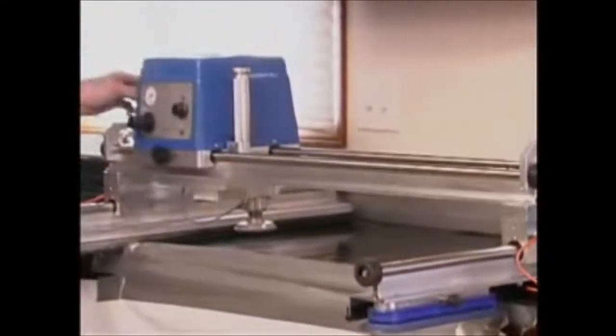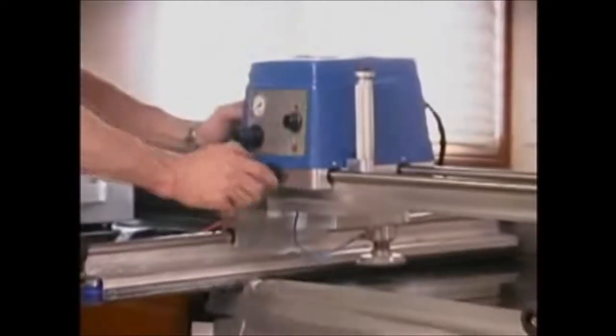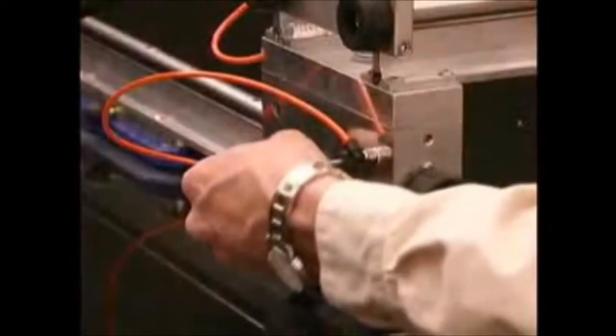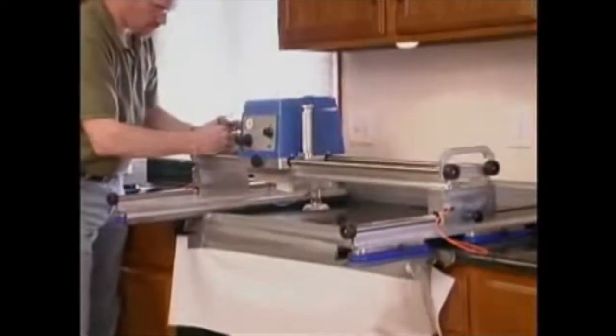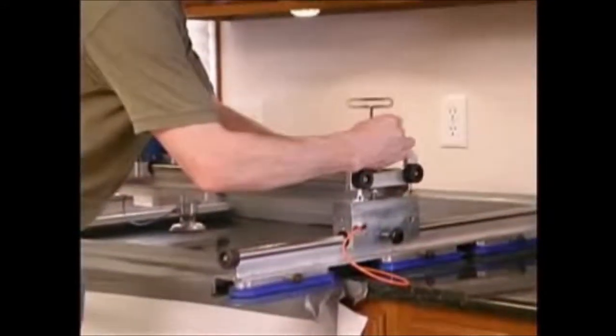Remove any dampness or dried slurry from the rails, moving the machine fore, aft, and laterally to clean the entire linear rail system. Next, roll the machine toward you so it is still over the stone. Again, turn the rail locks clockwise to lock the lower trucks on the rails. Do not over-tighten. Using the T-handle Allen wrench, remove the 2 button head bolts from the outside rails. Return those to the transport box.